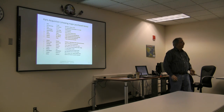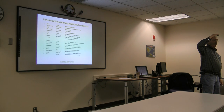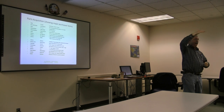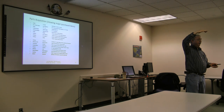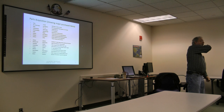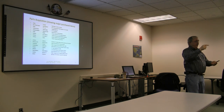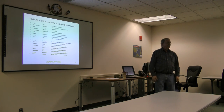If you have a satellite coming up over the horizon coming at you, and you want to transmit to it, you have to transmit low so that when it hits the satellite and gains in frequency with Doppler, it'll be at the frequency the satellite's tuned to, because it doesn't know where you are. But the receiver, you have to tune high, because when you're receiving it, it's going to be like a train whistle. The transmit goes like this and the receive goes like this. So you have to set those memories up in advance and tune it. And this device has a way to do it all in one, which is cool.